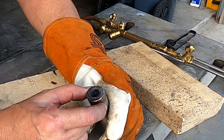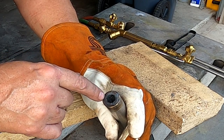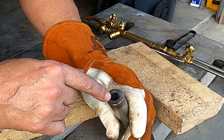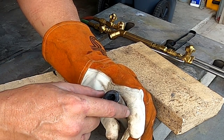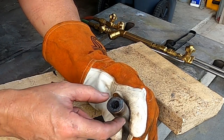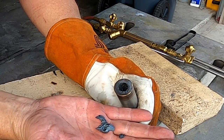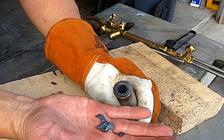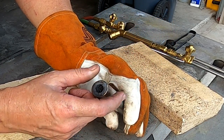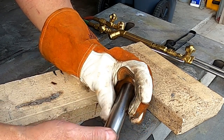On the stainless piece, I got pretty deep in there — probably a little over an inch. I'm sure that drill bit is de-tempered now, so I could probably just take a carbide bit and drill the rest of the way out. It was a little too deep for that torch with this setup. But the slag just fell off when I took it out of the water, so whatever's left in there a carbide bit will take out, and I'll have a nice piece of stainless to use.